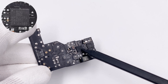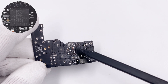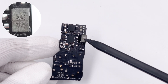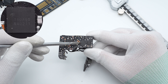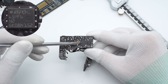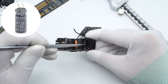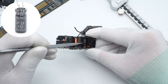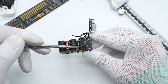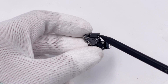The master control chip is Apple's customized model, marked APSLCA01, also used in Apple's 96W and 30W chargers. A MOSFET is from STMicroelectronics. This is a current transformer used for current detection. The primary switch transistor is from AOS and adopts DFN8×8 package — 700V, 160mΩ. Another MOSFET is also from STMicroelectronics. The transformer is wound and insulated with tape. A small capacitor powers the master control chip: 35V, 47μF. The small PCB next to the transformer is used for upper voltage feedback. A black safety Y capacitor is on the back, and here is the EL1014 optocoupler.